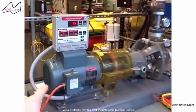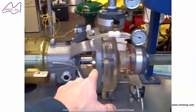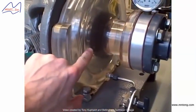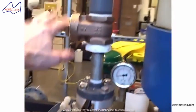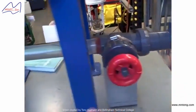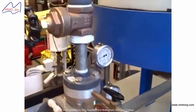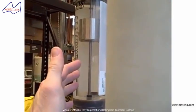Here we have a pump trainer. We have an electric motor with a horsepower meter through a magnetic coupling to a centrifugal pump. The pump itself is made of acrylic so we can see the spinning impeller inside, and we can also see the fluid go through. It's got a gate valve on the discharge and another valve on the suction. All the piping here is clear so we can watch the flow of fluid — right now it's all clear water. We've got a rotometer here showing us the amount of flow.